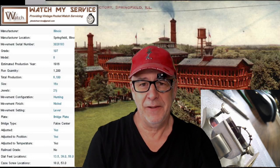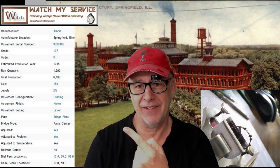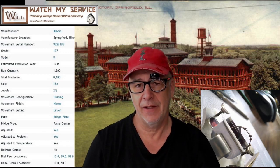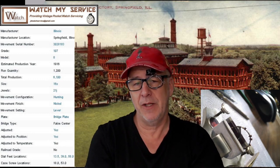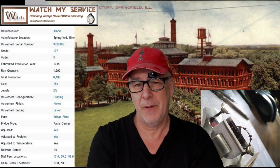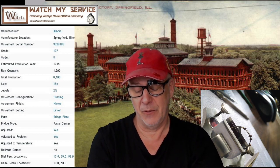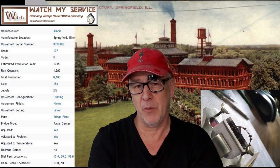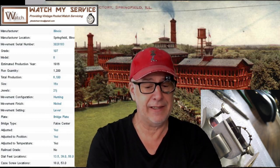Good morning, this is JD here again, welcome to my channel. I've got that Illinois thing up here again - a 21-jewel pocket watch. This morning I'm actually going to poise the balance on this Illinois pocket watch. But instead of watching me fart around with timing screws and undercutting screws, I decided to do a video just showing how you poise a balance to the best of my knowledge. It's not usually out of poise unless someone's played with it - with this Illinois pocket watch it looks like people have added timing screws just to slow it down, and they slowed it. Then I cleaned it and got it running really well.